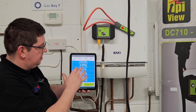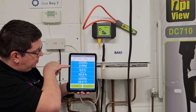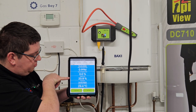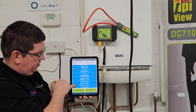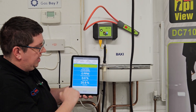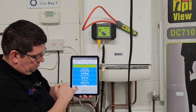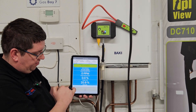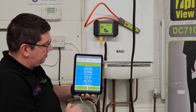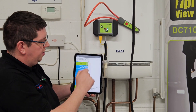As you can see, really nice big easy-to-read readings here. You've got your CO, CO2, oxygen, rated excess air, your flue gas temperatures. Especially if you're doing oil, the fuel selections at the top include natural gas, propane, light oil, heavy oil, biomass, etc. So we'll select natural gas — we want to do a burner reading.